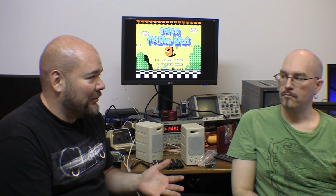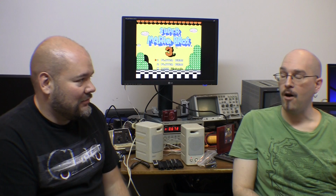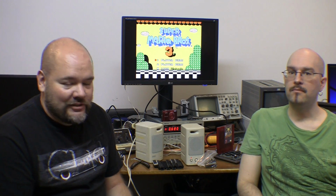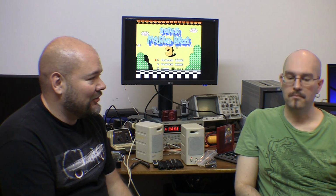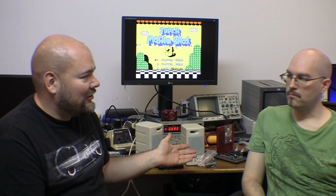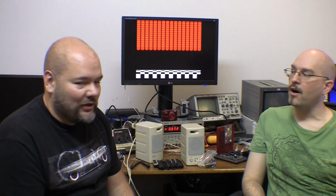They're all P's, right? 480p, 720p, and 1080p? Yeah, and then 576p for the PAL mode, and 720 and 1080 also for PAL mode. So it's not only NTSC consoles we can work with here, it's PAL as well. Already tested, we've got PAL chips and all that stuff already going. And we're internally generating clocks, so it's not a problem. And it auto detects between NTSC and PAL.